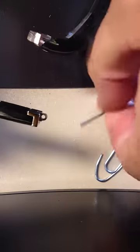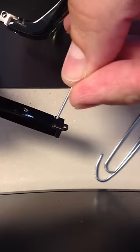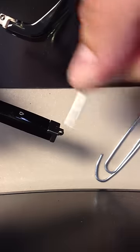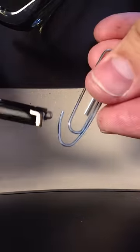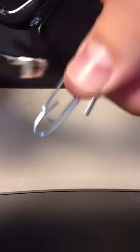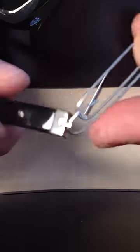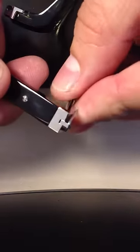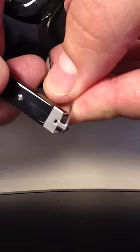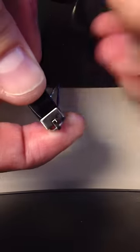So a simple little fix is I'm going to pull this piece out and then stick this piece of a paper clip that I just snipped off in there to jam it open so we can align the two. The easiest way to do that is I just made a little hook there. Put it through the barrel hole like that. Now you notice I can bend it like that to pull that piece out — you see the gap that's opening up there? That is where you're going to stick this piece.